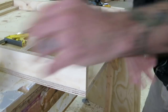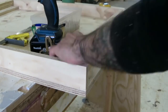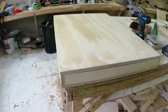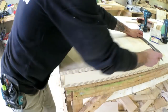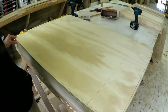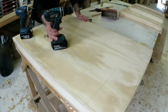This is the other half of the top and I'm just forming what is essentially the mortise — simply adding a rib at the right distance back from the edge. The actual work surface top I'm just screwing down, so that way if I need to replace the bench tops down the track I can do that pretty easily.